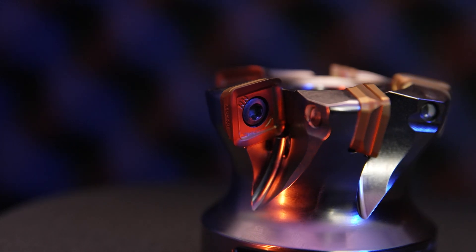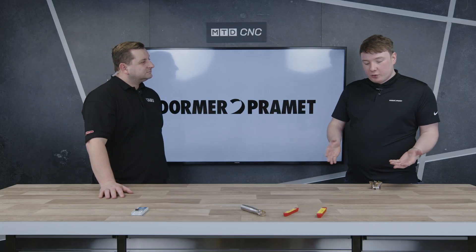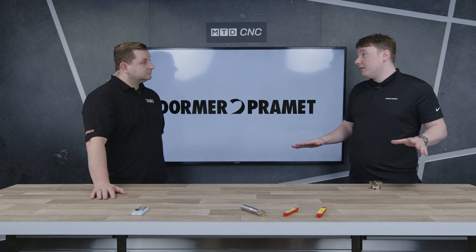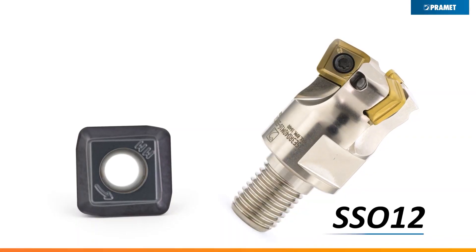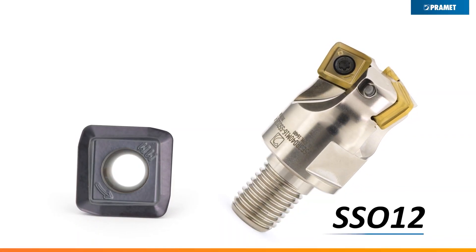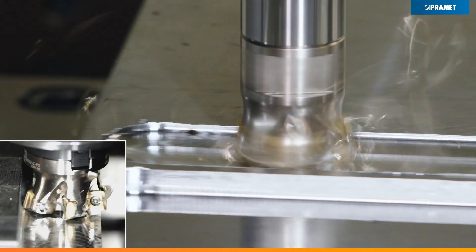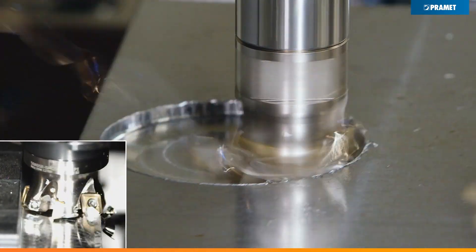So what's that compared to a standard face mill? It's a much more versatile tool. Your standard face mill is designed just to do facing, but a Hi-Feed will do everything from facing to Z-level roughing, around the outside of a job, trochoidal milling, ramping, plunging — all types of operations. I've got to say I do love watching the plunging videos, which we do actually have.